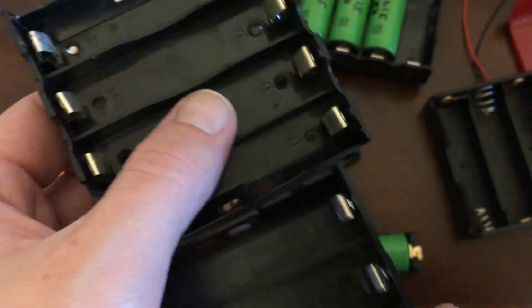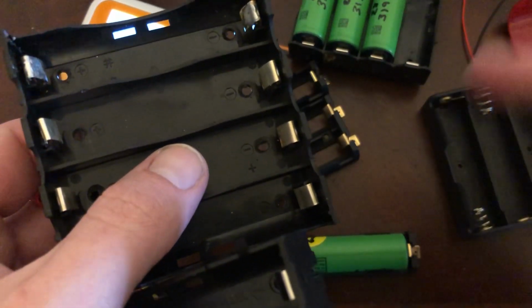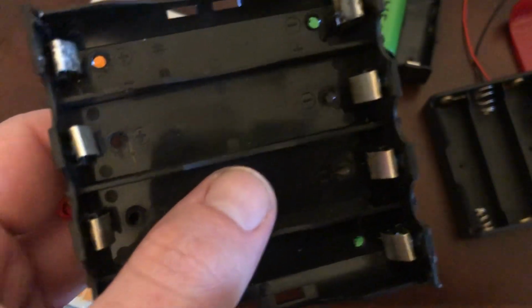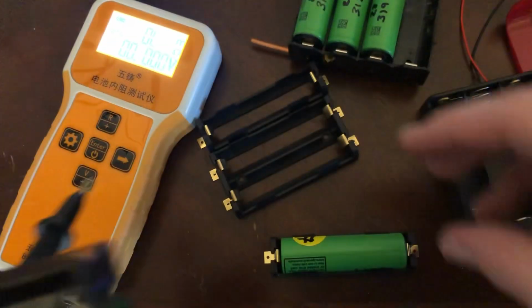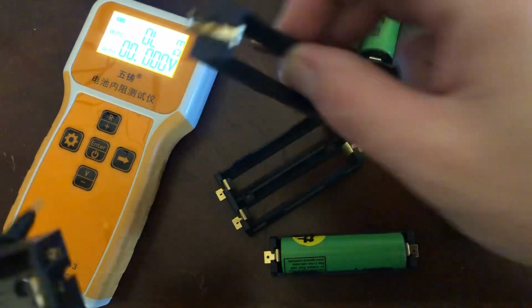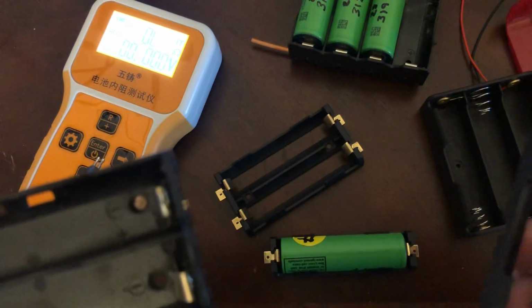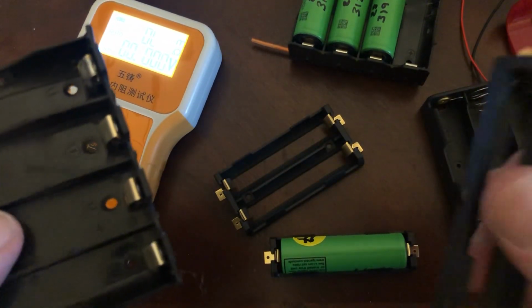But if you were to put it in a rig, I have one of the ZKE Tech ones that has almost no resistance and a 4-wire tester, you know, it might only drop to 3.65, less resistance. And this one might only drop to 3.62 because it is slightly less resistance than these, but not perfect. You know, it has a little bit of resistance.